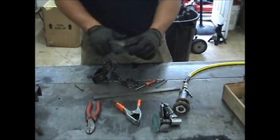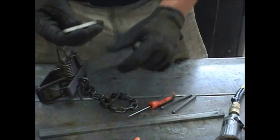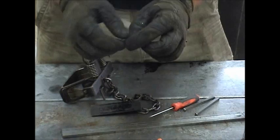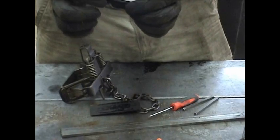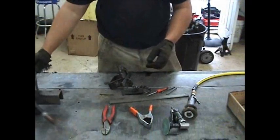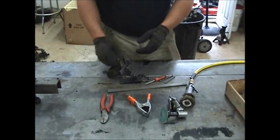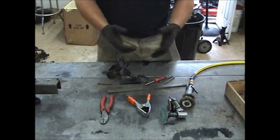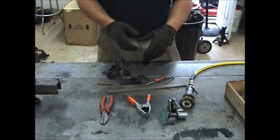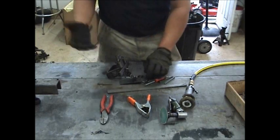I painted it to keep splatter from building up on it. If you're going through a bunch of them, just keep an eye on the splatter marks — you don't want your double jaws to get in there cockeyed. I have a Millermatic 250 welder, but you guys don't need anything too fancy. Harbor Freight sells welders. If you can't afford that, go to some machine shops around town. Most good old boys there, if you tell them you want to learn to weld and modify traps, they'll help you out.